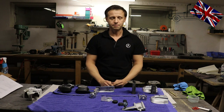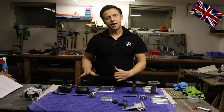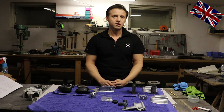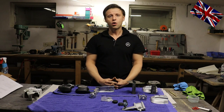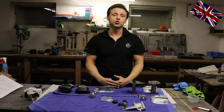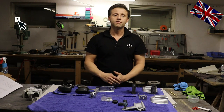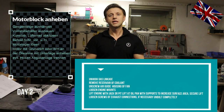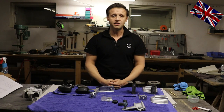When your car is shaking and vibrating like a washing machine in spin cycle, the cause is most probably worn-out mounts, amongst other things such as unbalanced wheels. We will show you how to do it yourself. The engine needs to be lifted some 10 to 15 centimeters, or until the housing of the gearbox is touching the firewall in the engine bay. We'll give you a drop-down so you remember how to remove the exhaust manifold, and we will start right after the introduction.